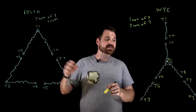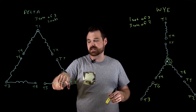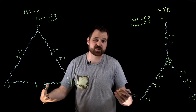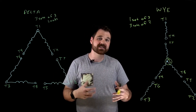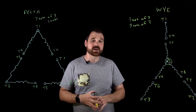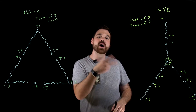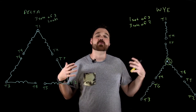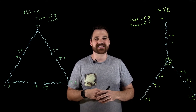Same here — we don't have access to what would be T10, T11, and T12. They're actually pre-connected at the factory, but they are the same windings, just configured in a different way. Thanks for watching. Make sure you check out the two Delta videos and the two Y videos — those are going to help you make the low voltage and high voltage connections with these motors.